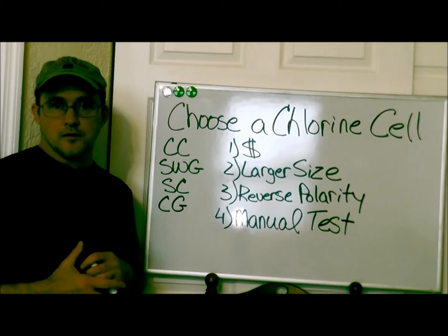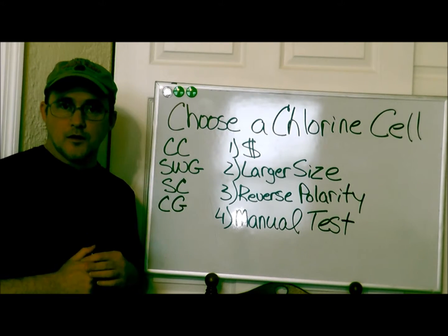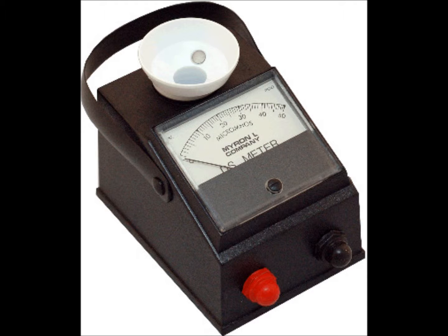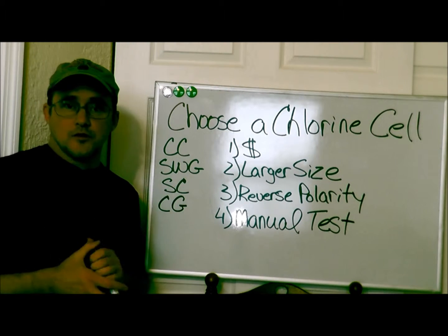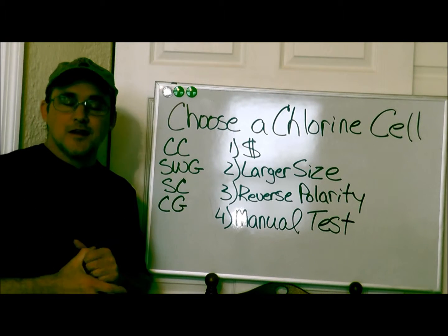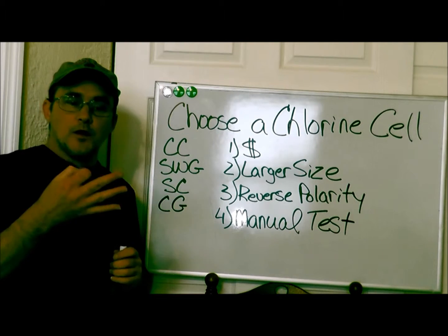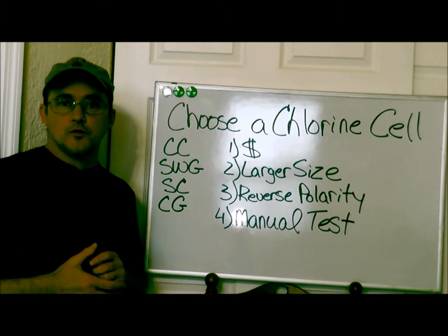Manual testing is one of the most important things to do. When I had my route in Arizona I used a digital meter, and at the Y I used a Myron analog salt meter — one of the most accurate I've used since working in pools since 1999. You want to test the salinity of the water and not simply rely on the system's reading. Get three different tests: test it on the system itself, do a manual test, and also take a water sample to your local pool store for analysis.